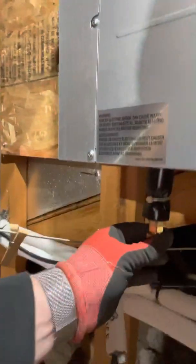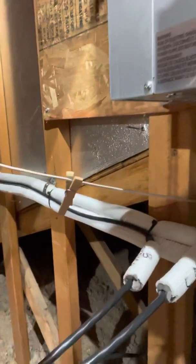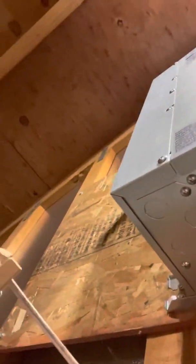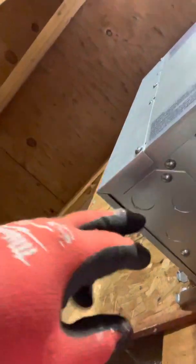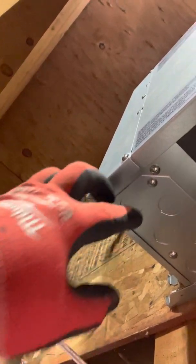Tomorrow we're going to be running the primary line sets here. What we also like to do is when we run our communication cables, just make sure you label them — we know where they all go because they all go up in those little knockouts. There's only five of them, and there's a little secret to these. We like to use a fitting called a snappy. When we use this one, we make it a dual snappy connection because we use it for the outdoor connection, and we put the communication and power feed through that one to the outdoor unit — but I'll show you that tomorrow.